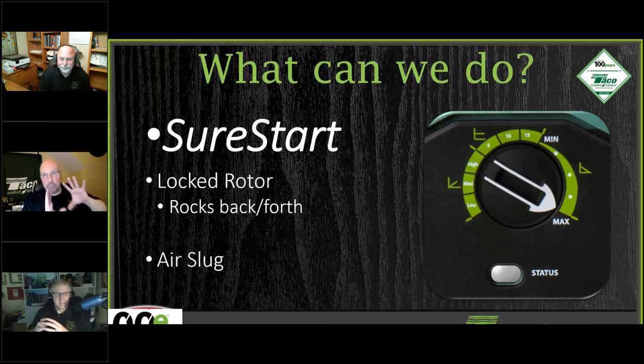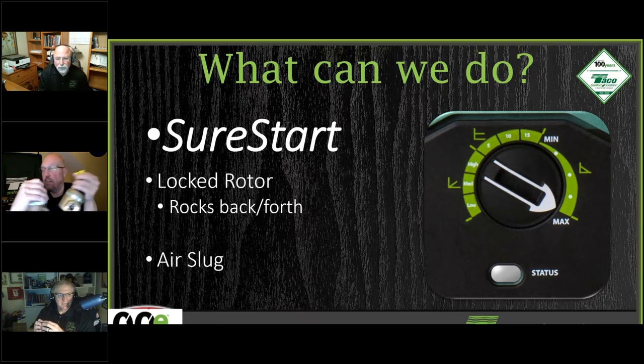So that's built into our ECM circulators if your water's that dirty in there. If you start seeing Sure Start happening quite often in your systems, then you're starting to look into, hey, I've got an air issue and a dirt issue. I might need to put more enhanced air and dirt separators into our systems, if your circulator is getting seized up quite often.